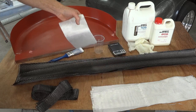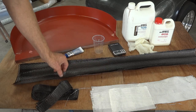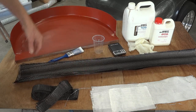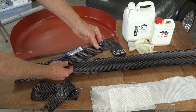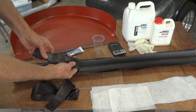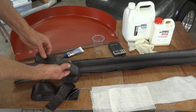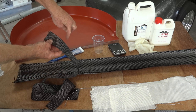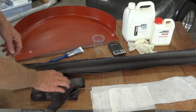The carbon fibre is 2x2 twill that drapes nicely. The glass cloth is the same layup as the body — carbon, glass, glass, carbon. And just to make the edges a little bit stiffer, there's some 50mm carbon tape which is a lovely product because it's nice and tidy — it doesn't have nasty edges. The only downside is that where the fibres go back and forth you end up with a little thick bit at the edge, but for this job it's fine.